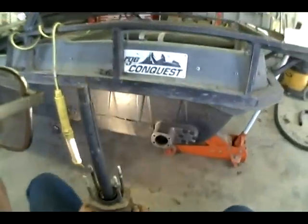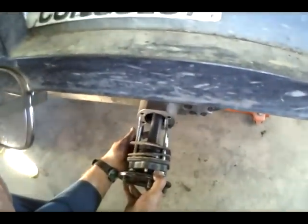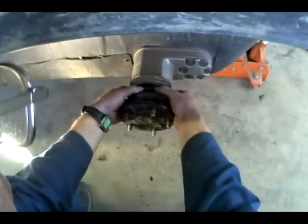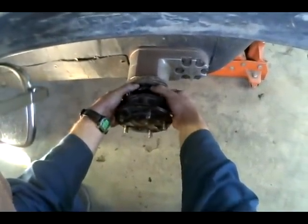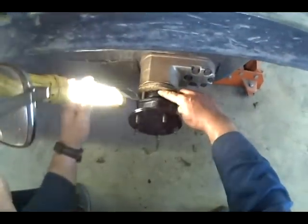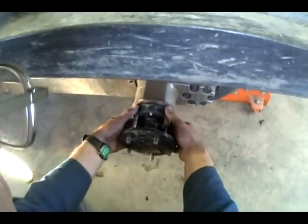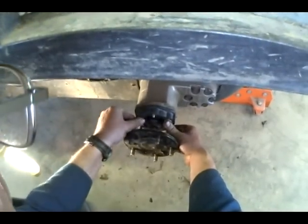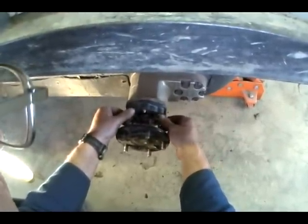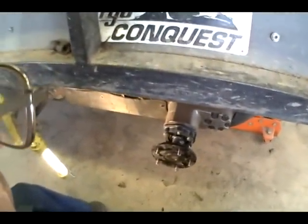Try to make sure your grease nipple is up. Remember, this is a dry run, so I don't need my sprocket in there. Three gaskets, bearing. Right there is the little grease hole, if you can see that. And then my grease nipple is up here. So this is all going to slide together like that. And it ain't gonna work with those bolts.